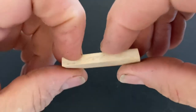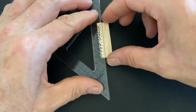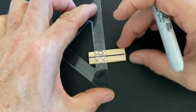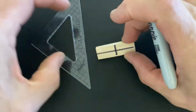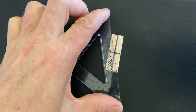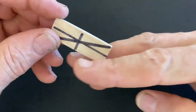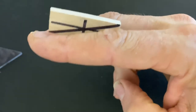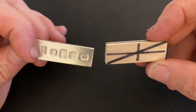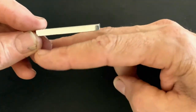Taking this simple shape as an example, let's look at how patterns are designed so they can be pushed into the clay. Every pattern has an imaginary parting line. This is how far half of the pattern is first pushed in below the surface. Each pattern will be different and may have a number of options for where the parting line can be. These are a few of the options for this small piece of wood. Even a diagonal parting line could work with this simple shape. Using this ingot of silver as an example, it has the same size and shape as the bit of wood. However, having texture on one surface, it can only be pushed into the clay in one direction. This would be texture side down, so the parting line would run the length of the thin side.